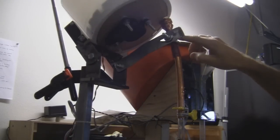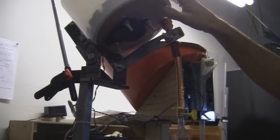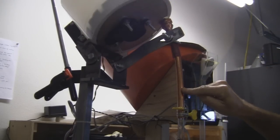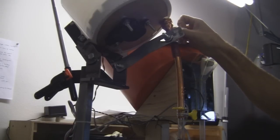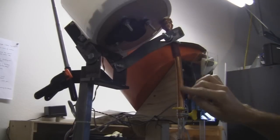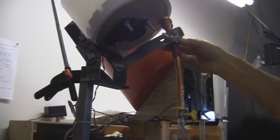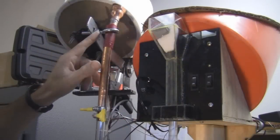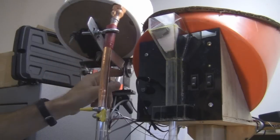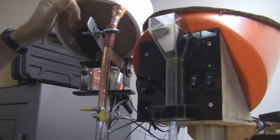The feed tube has a bit of a curve in it — that's really going to depend on where you locate the feeder on the bench relative to the press. It does have a bend in it. This is a half-inch copper pipe with a half-inch to inch-and-a-quarter or inch-and-a-half reducer — you can get this at Home Depot in the plumbing section. I mounted it to be held on with a bracket using an eye bolt with a loop, bolted on like that. I did solder this tube together so it would never slip.